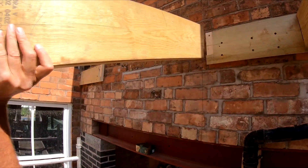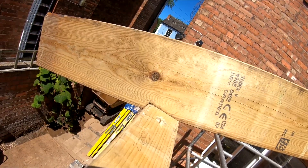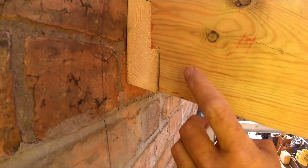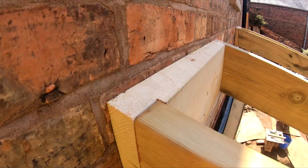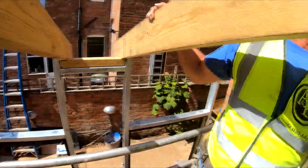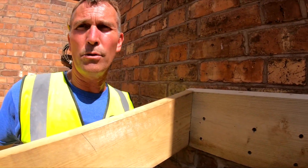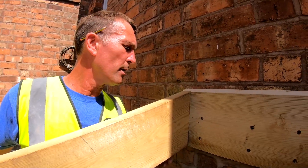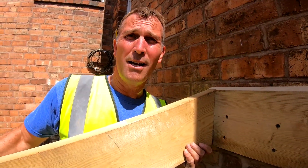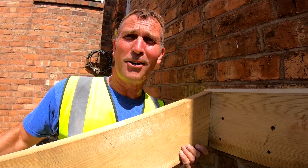Put this up to the back of the wall plate, up onto the housing, and push her in. Have a look at the back of that wall plate John — see if she's nice and tight. Looking good, yeah. Have a look at the side here as well — looking good. We'll put some fixings through into the meat of the timber at the back. It'll be absolutely solid. It's a little bit more extra work but it makes a better job. It probably took me 20 minutes longer in total with the chopping out and recessing, but it gives a better result. Any questions, put them below, hit the like button, and check us out on Instagram. Have a great day — see you soon guys.